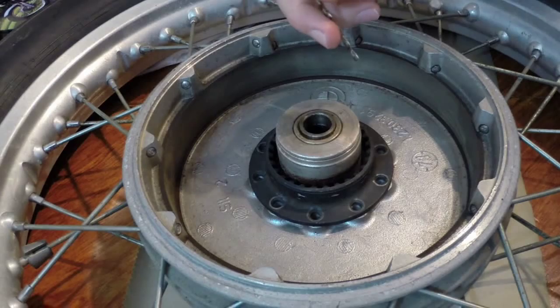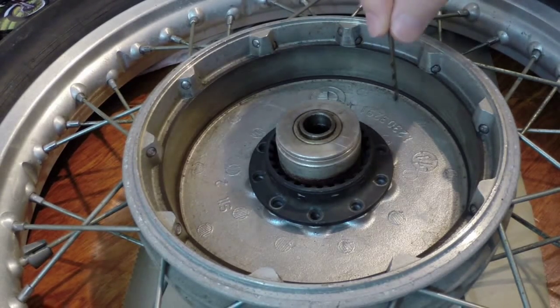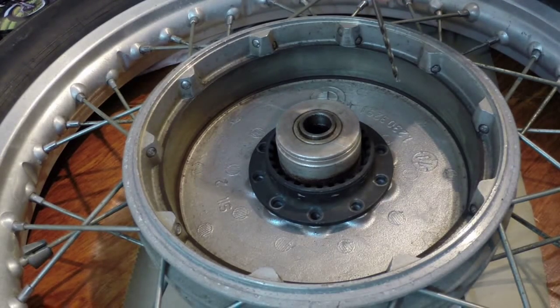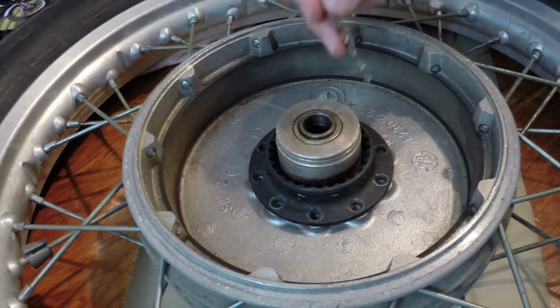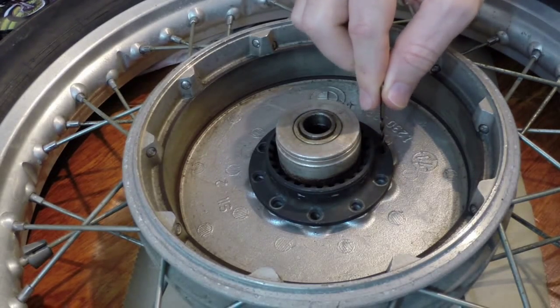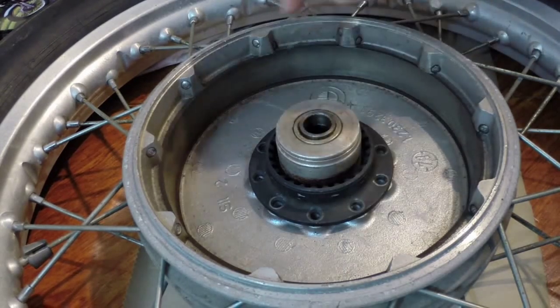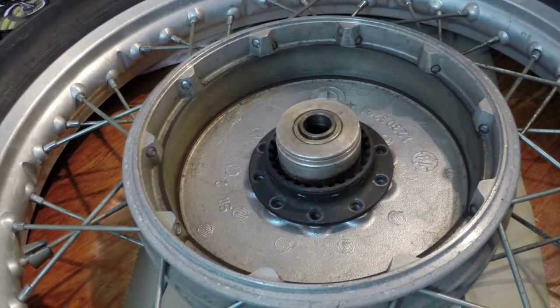This is a pilot hole, so you want it to be as straight as possible into the rivet. You're going to follow this up with a 3/16-inch drill bit, and it will basically follow the pilot hole you drilled with the 1/8-inch. Use a high quality 1/8-inch drill bit, drill straight down into that rivet a half inch. Do that for all — I believe there are 10 rivets in this driving dog.